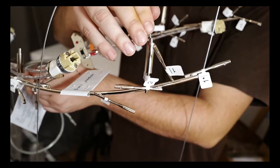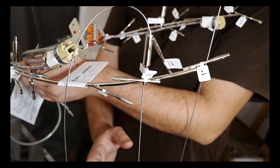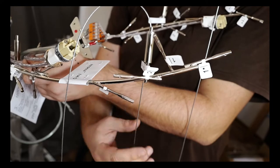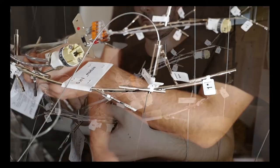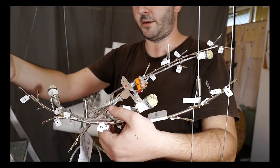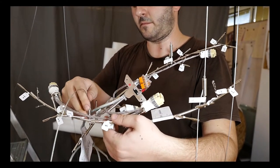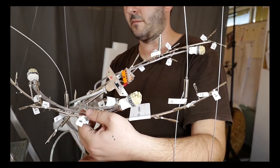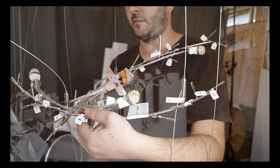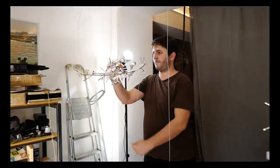Insert the end of the correct steel cable in the nozzle of the holding mechanism until the end of the cable appears through the lower aperture. When that happens, pull the cable out of that lower aperture. If it goes too far, or if you are not correctly matching the labels on the drilling pattern with the labels on the holding mechanism on the metallic frame, you can pull the cable out by pressing on the nozzle inwards and pulling the cable out. Place the structure on the cables at a height that allows easy access for the mounting of the further components.